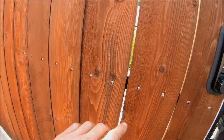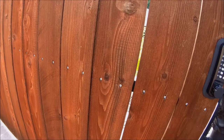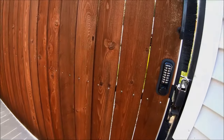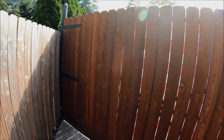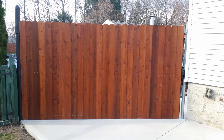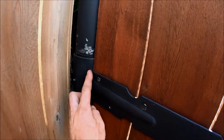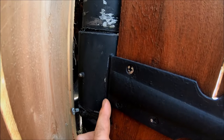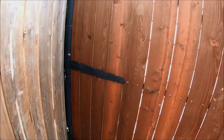Holding all these pickets in are stainless steel self-tapping screws — they self-tap right into the 14-gauge. I did add grease to the threads when I put those in so those holes hopefully won't start rusting prematurely. Over on this side, I felt it looked kind of ugly — it just looked like a fence — so I got these hinges at a flea market, cut the hinge pin off, and siliconed and screwed them on as decorative pieces. That makes it look a little heavier duty.